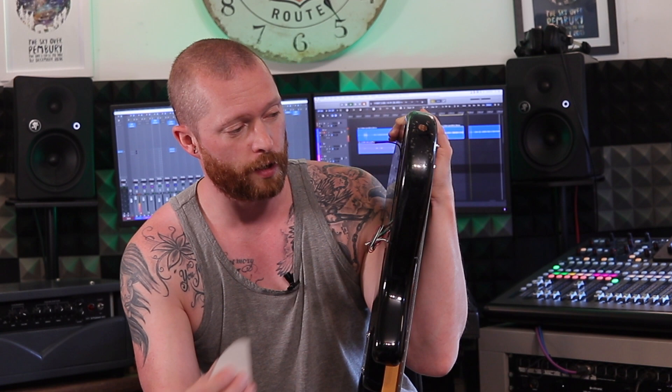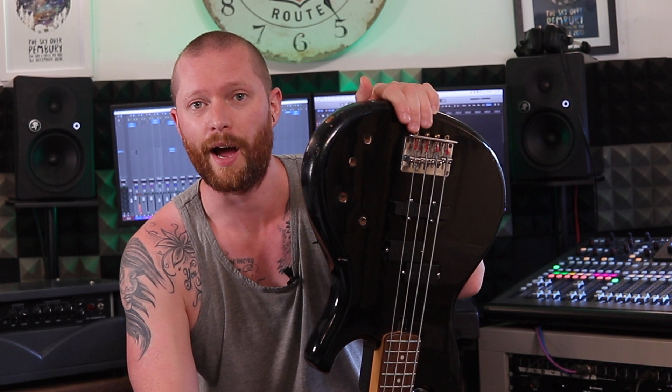I ran a route around the inside of the cavity to make sure it was all the same depth, put a load of glue in, pushed the timber piece in that I made, and left it clamped for two days — just used PVA — and that is absolutely bulletproof. I'm going to show you a video of how I did that.